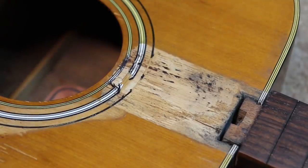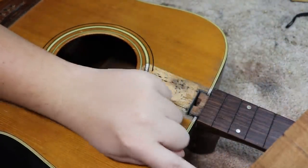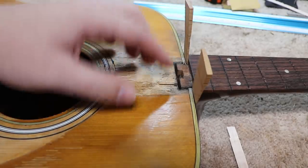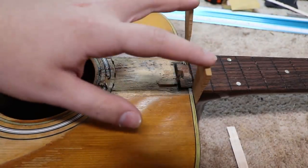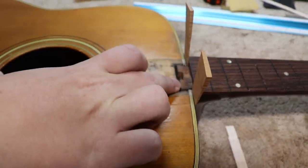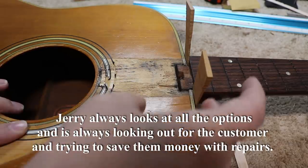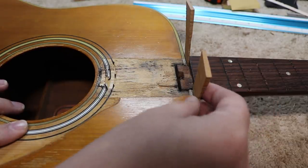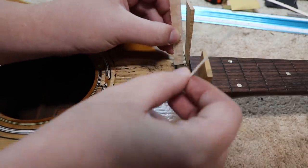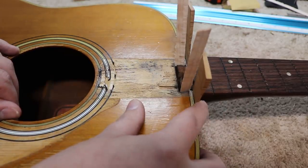What I'm going to do is try to fill those slots in so that we have the strength behind it. I've already traced out some lines on this block here — I've made little wedges, I'm going to cut them out and size them up to fit down there. We'll dye them real dark so you'll never see them. The best way would be to carve out the interior to make it flush and put the wedges on the inside, but that takes a really long time. Seeing as this is a customer that Jerry knows and we're trying to save money, this is the fastest way, and this isn't necessarily the best way but it's the best way for the time we want to put into this.